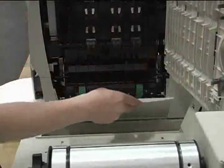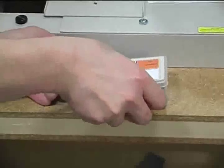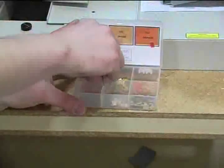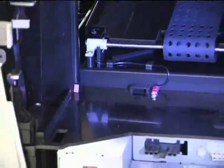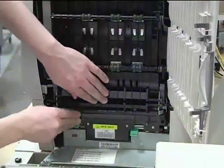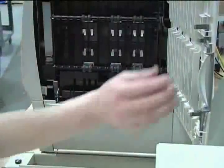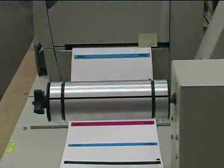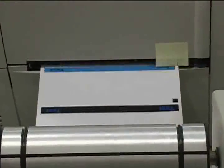Start by turning off the printer and opening both side panels. Pull both clips to unlatch the fuser and lift it out of the printer. It is best to start off with a small shim, like a 10 thousandths or a 15 thousandths, and then move up to a larger size if necessary. Adhere the shim to the small inside corner of the front side of the printer, as shown here. Replace the fuser, close the panels, and turn the printer back on. Don't forget to replace the tape used to keep the paper deflector depressed before starting a new print job. Observe the new print job and determine if any issues with drifting or print quality have been fixed or have at least become less significant. If the results are the same or show some minor improvements, then repeat the process with a different shim size.